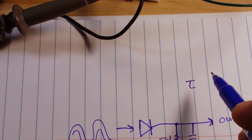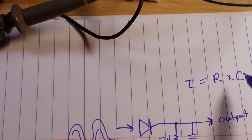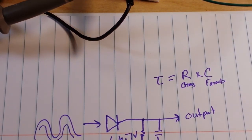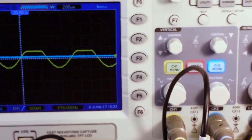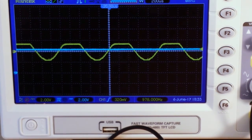If you want to work out these values yourself, the RC time constant is equal to the product of the resistance and the capacitance — that's in ohms and farads, so watch your decimal points. There are other ways to make a peak detector; this is just the simplest one. If you have an audio circuit where you want to visualize your peaks, this is a quite simple way to do it. This clipping is simply due to my function generator and not the circuit itself. If you like this, please give me a thumbs up, feel free to comment, share, and don't forget to subscribe — I'll see you next time!